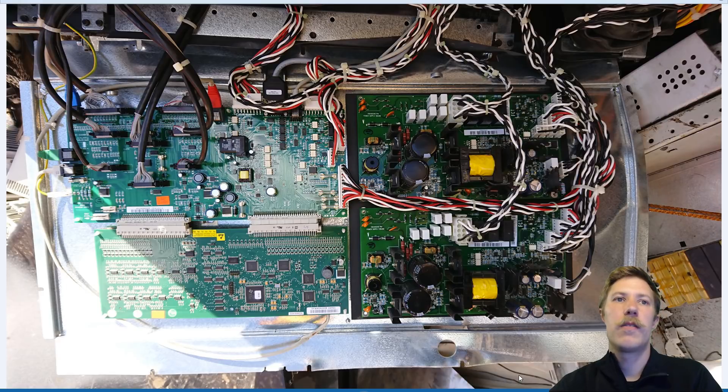The control part on the left side contains a gate driver control board on the upper part, which also has all connectors down to current transformers and network connections. The CPU board is connected by two large DIN connectors — the two gray ones — and it's designed smartly so you can actually upgrade the CPU and sensing calculation board itself while keeping pretty basic inverter hardware for the rest of the cabinet.